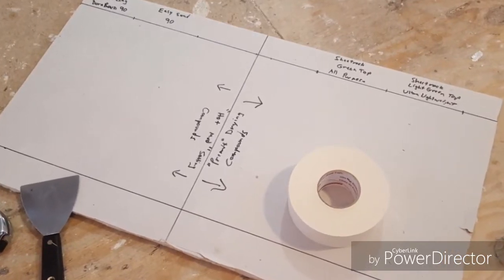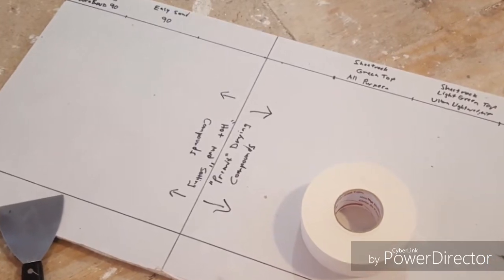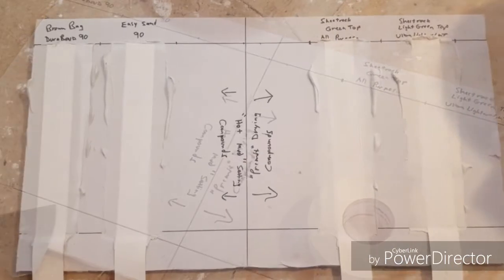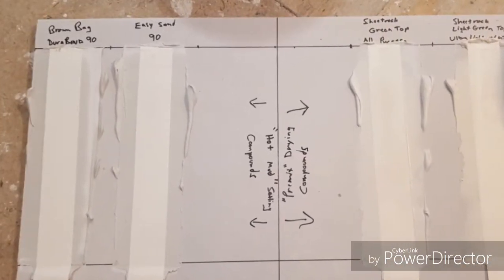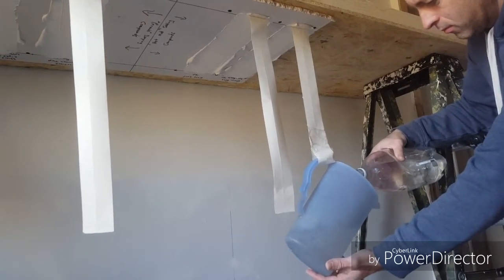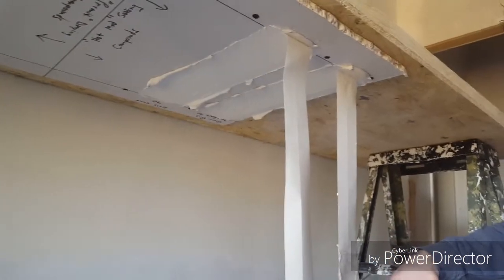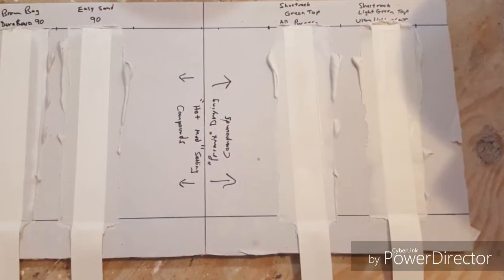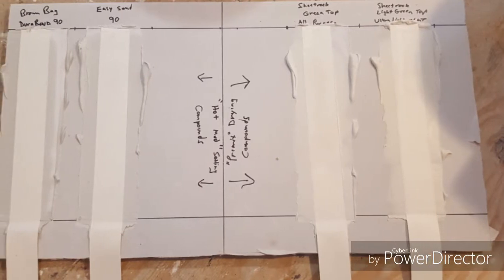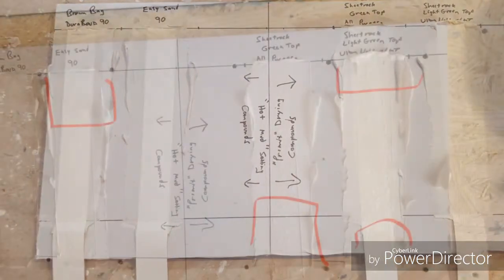When I'm going to be taping drywall, I don't want the tape to fail. We've all seen cracked drywall tape where joints are exposed and tape is falling off. The only way to really find out is to test it. My initial test used weight — based on how much water a pitcher would hold before the tape fails. What I found is that they all fail at about the same point, but it's not a useless test — it's telling us the paper fails before the compound fails.